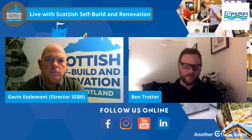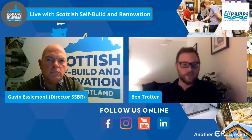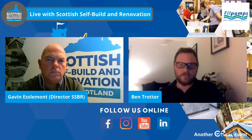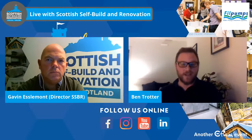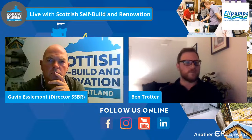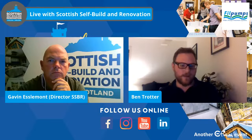And providing that that little minor bit of maintenance that the customer has to do, topping up the salt, providing they do actually do it, then, for instance, our main iron treatment vessel, which is a little cabinet system with low fouling resin, is very commonly used, and providing the salt is topped up, that could go for about 2 or 3 years before the media needs to be changed and it has a proper overhaul. So yeah, other than topping up salt, very, very low maintenance.